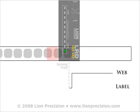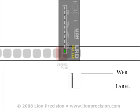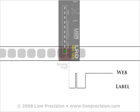If the sensor is already indicating the presence of a label when it encounters a splice, the sensor is not affected. When the trailing edge of the label passes through the sensor, the splice maintains a total thickness greater than the liner only, and the sensor does not see the gap and incorrectly continues to indicate the presence of a label.